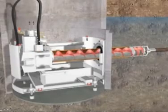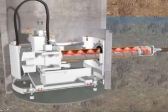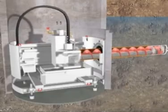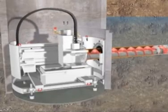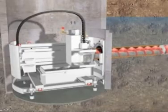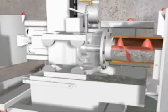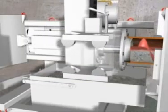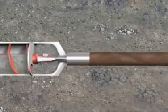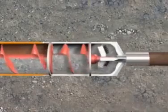The pilot rods are then followed by a reamer coupled to steel casings with augers inside. The ground is excavated by a special cutting head on the reamer and transported by the augers back to the muck skip in the working shaft. The reamer with the groundwater auger is connected via steel arms with the pilot rods.